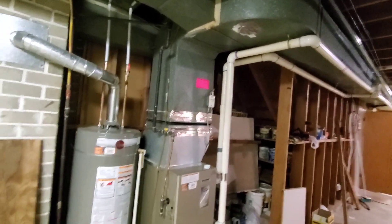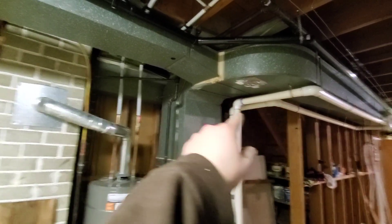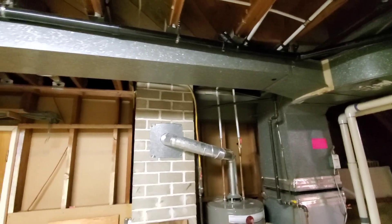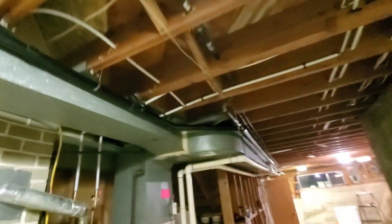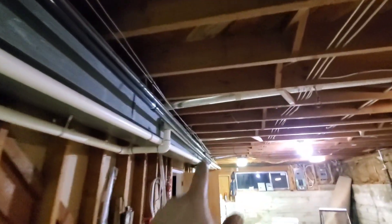What you see here is a forced air furnace. We have our furnace, our air plenum, and then we have our trunk line that goes in either direction for heat. We have a duct going that way, a duct going that way, and one coming this way up for the kitchen. This is our trunk line, and then we have a couple of takeoffs.